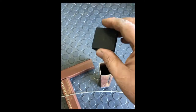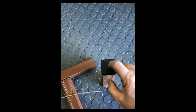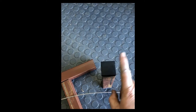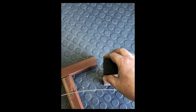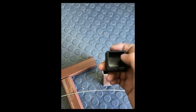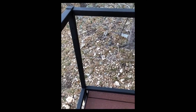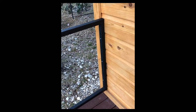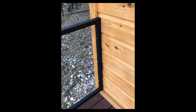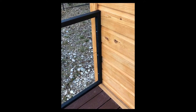You're probably wondering what I did with the tops of these posts - I found these little plastic inserts and they just pop right in. You take a rubber hammer and pop them right in and they look really good - you probably couldn't even tell they were in there. And if you're doing a cable rail out of one and a half inch square tubing, you might come across the situation where you need to mount the cable rail to a wall and wonder what kind of connectors to use. I'll show you what I did.